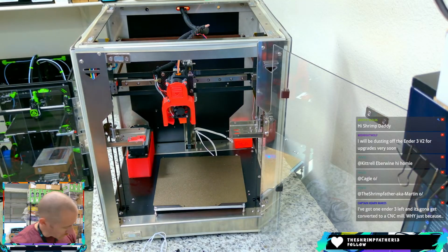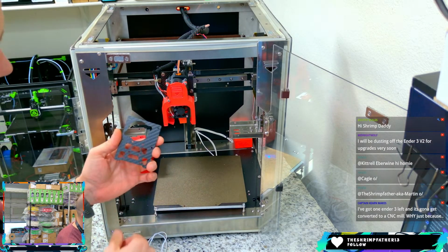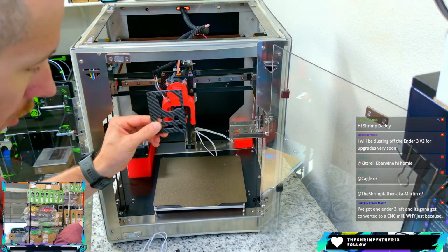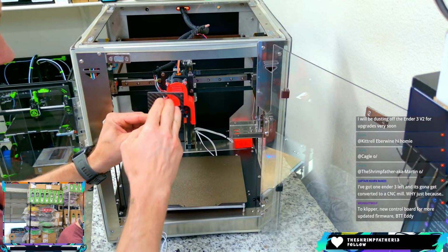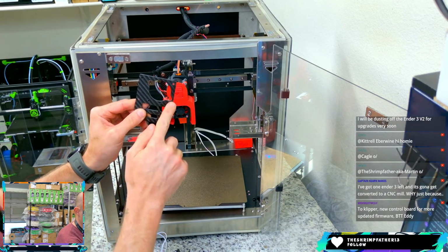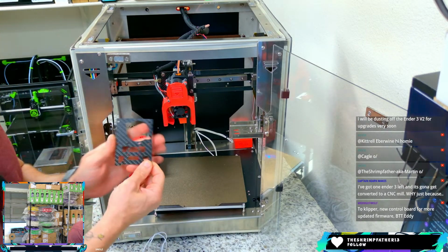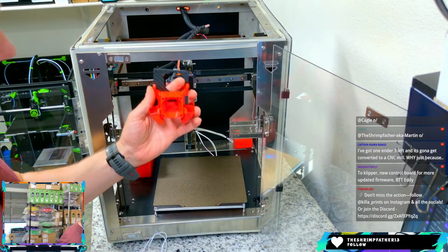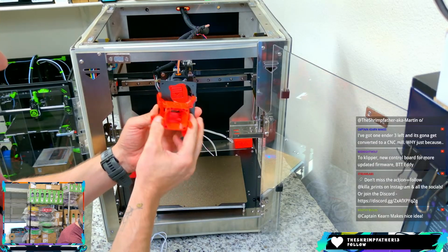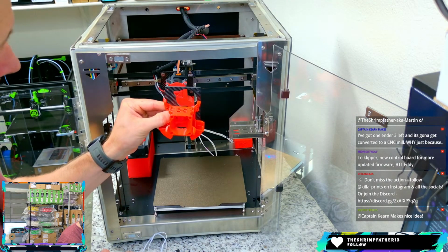Stage 2, we swap out the mounting plate for the BMG, which is again a full-size BMG, so a lot of mass there, with this plate, which holds an orbiter. So the orbiter motor comes out the back side of this. That's why there's this one here. And then on the front, I think I've got the part. Here we go. I modified the LH Stinger hot end to be able to mount to the plate. Orbiter goes on top, kind of sticks out through the back here.